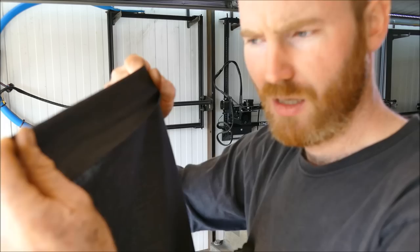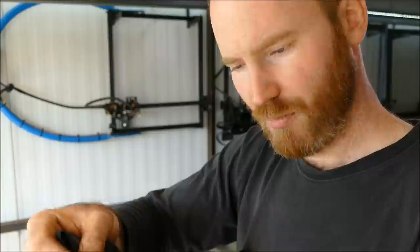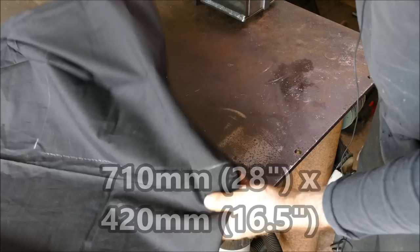Make sure you've got plenty of height. For the top part we need quite a large hem — about 50 millimeters or two inches. For the bottom we can get away with just 12 millimeters or half an inch. Square that off and cut it out.